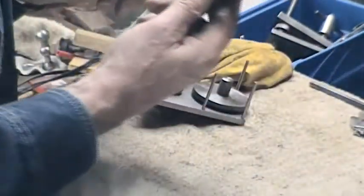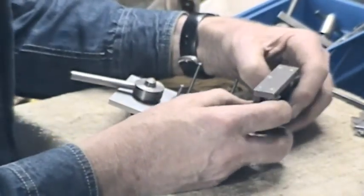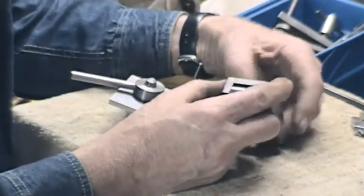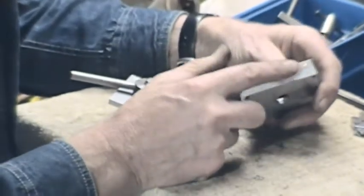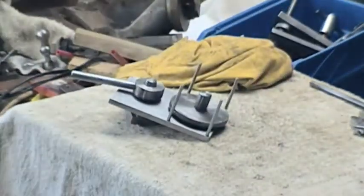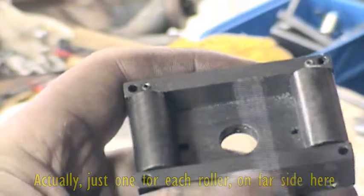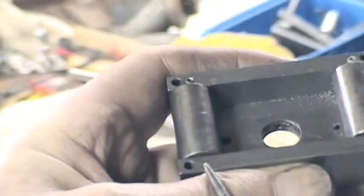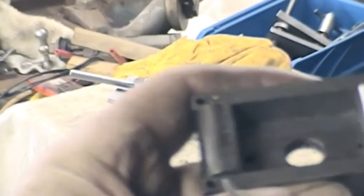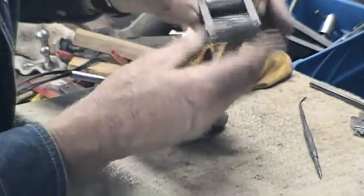Now what we might call the business end. This was made — instead of welding anything, I actually took a center piece of bar and two small pieces of bar, and we drilled those symmetrically in a pair. We've got two little set screws each side, and the larger holes are for the guide pins. The rollers are just mild steel but they have been heat treated and case hardened.